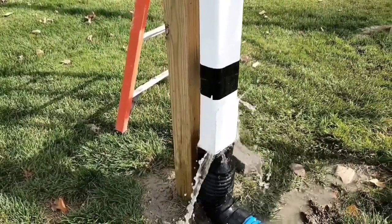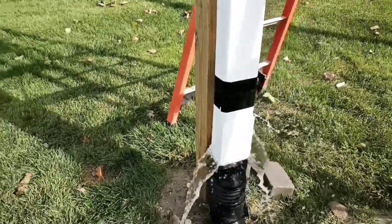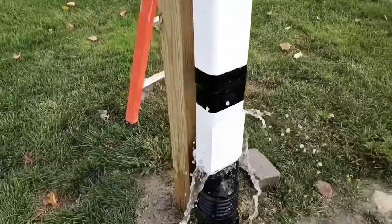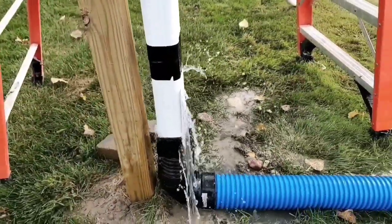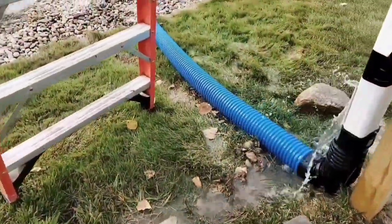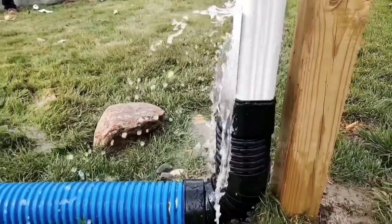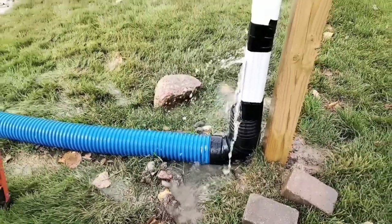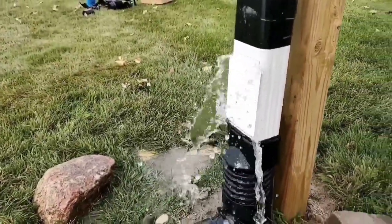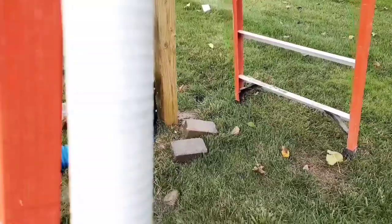Again, this is my opinion as a contractor of 35 years, and this is based on what I can tell. You're going to lose water during the big rain events. When you need these things to perform at their best is during a torrential rain — that's when people have flooding of basements, flooding of crawl spaces. A light misting rain, that's not the one you're worried about. You're worried about the one where you're trying to flow a lot of water through your gutter system. You need that downspout and the underground to perform really well during the big rain events. That's what we're testing all these clean-outs and leaf filters for — testing them all during a thunderstorm, during a decent rain. How do they perform? Do they fall short?